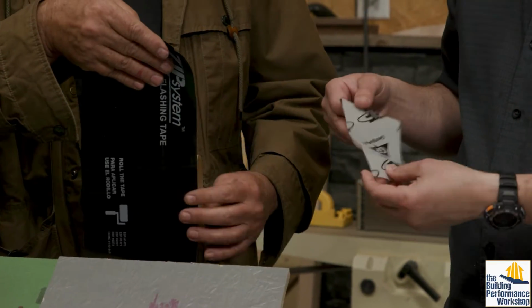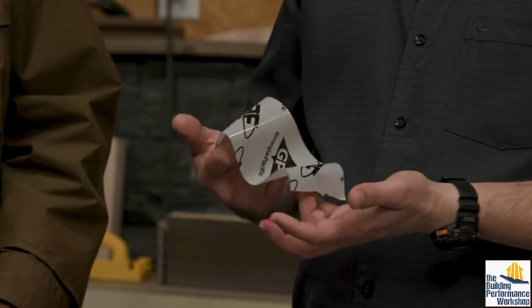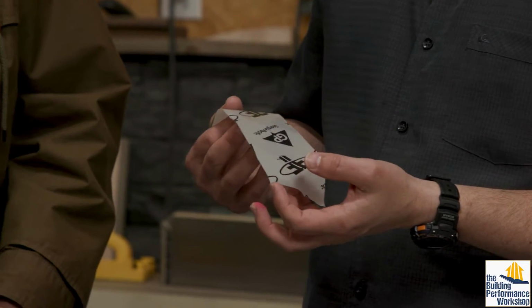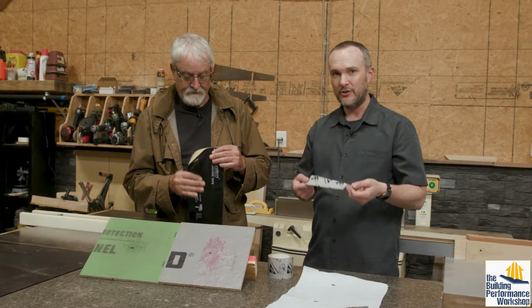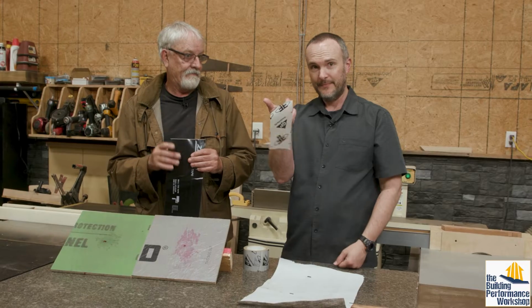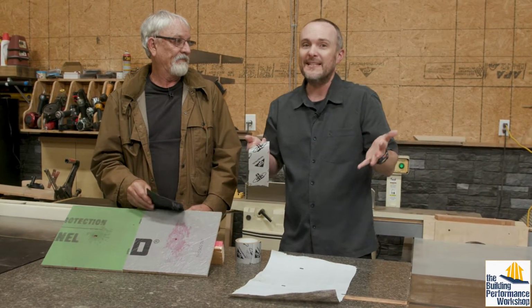Yeah, right. And they're all very sticky. This, just to remind everybody, is like shipping tape, but it's made to withstand UV. Is that right? Yep. It's built on the chemistry. We achieved 0.4 ACH50 with this. I was even surprised about that. I thought, wow, if we could hit 1 ACH50, that'd be great.